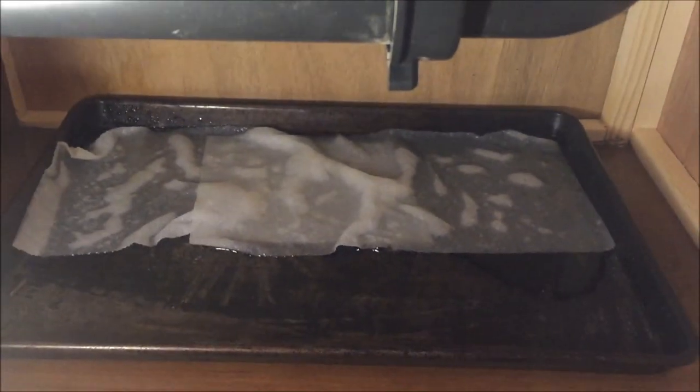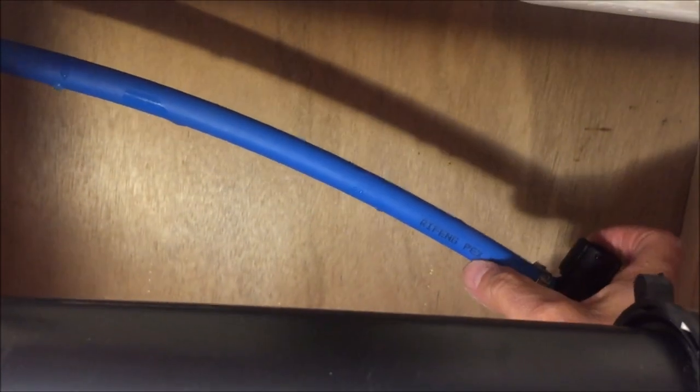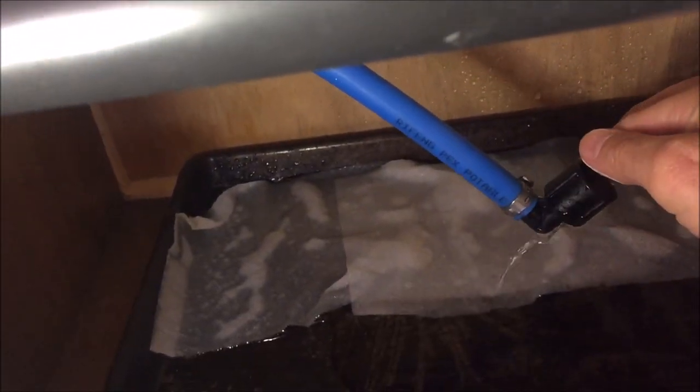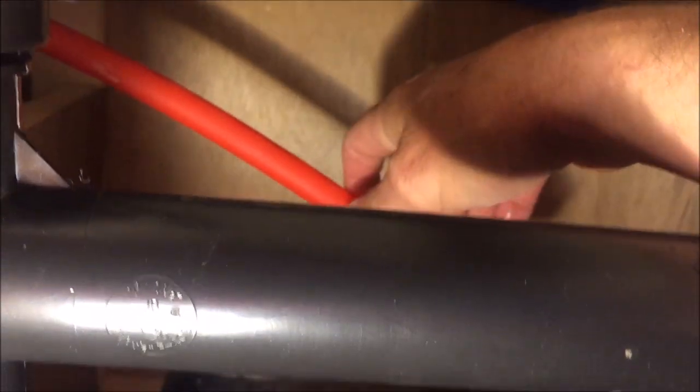I've got to dry this up and then we're going to replace this faucet with a residential type faucet. On this particular faucet they ran PEX, and you have this type of screw-on fitting. I've seen a lot of faucets in the past day, and I know this is not the only way they do it — they have some kind of quick-release gadget. You'd need an adapter, and the more pieces you have in the puzzle, the more chances you have for a leak.